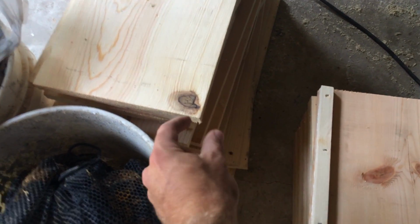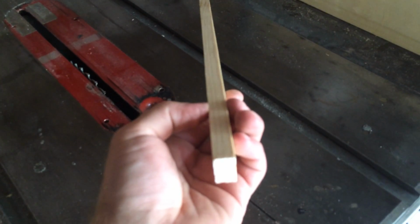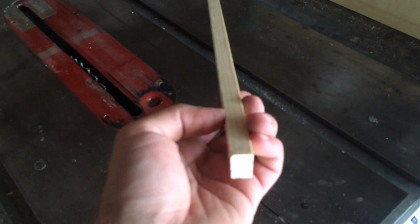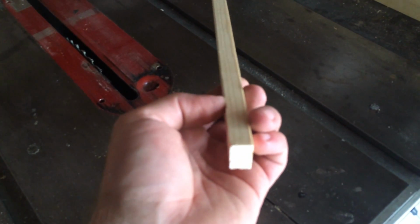And then the scrap, because these are 11 1/4 from the store, so you got this little scrap that's about 1.5 inches wide. I ripped that down into these strips that are 19 7/8 by 1/2 by 3/4. Now the 1/2 is more than you need for proper B space, but this means that it will give them 3/4 of an inch below the frame.